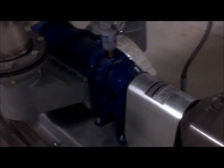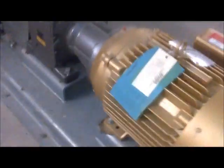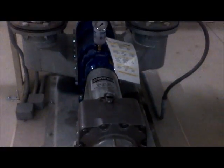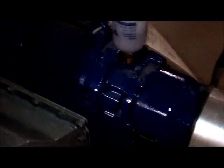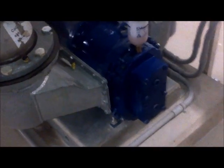That's 840 GPM. Here's the larger pump running — as you can hear, very, very quiet. It's not at full speed; it's at 1100 RPM. The top speed of the pump is 1770 RPM. And this is it at top speed — much louder.